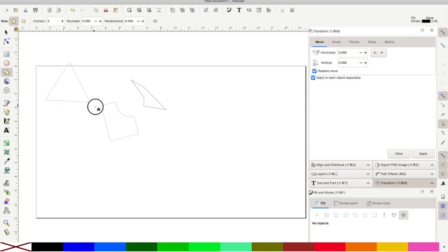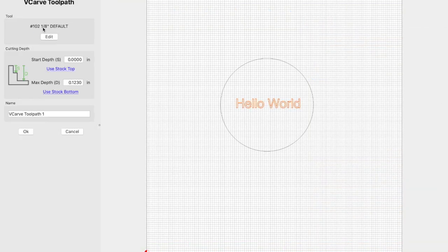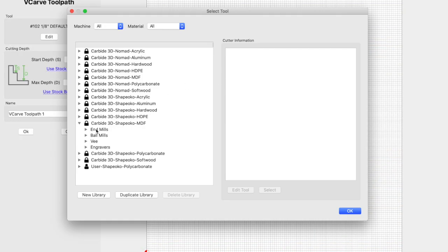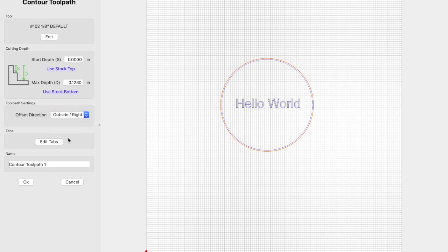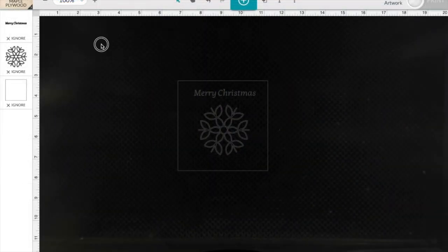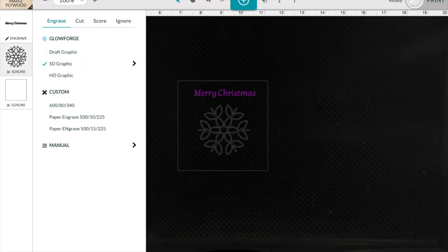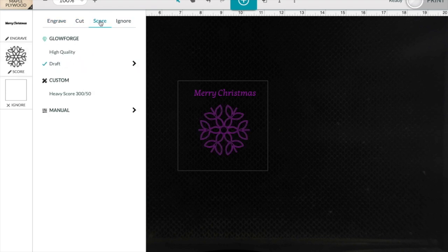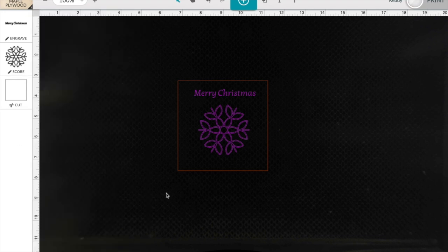Interestingly, software like Inkscape, Illustrator, or Affinity Designer all export to SVG — a format which Carbide Create supports and can import, meaning Shapeoko folks can also design in these programs. In fact, Inkscape has become my editor of choice for both machines. With the Shapeoko, once you have your design, you use the toolpath section to define what kinds of cuts to make — VCarve, InsideCut, OutsideCut, Trace, and more. Similarly, you choose cut types in the Glowforge web app: cutting, scoring, and engraving. So in mechanical and project flow terms, there's a lot of similarity — create a design, define the cuts, send it to the machine, and press go.